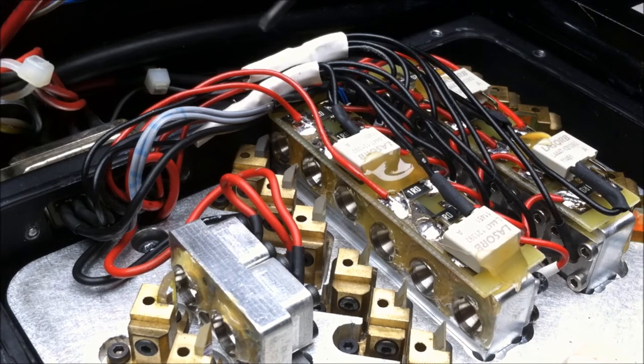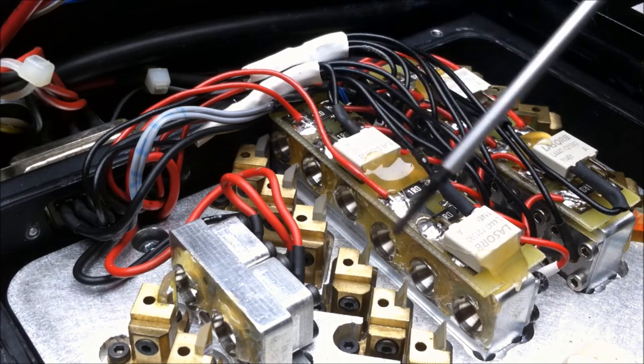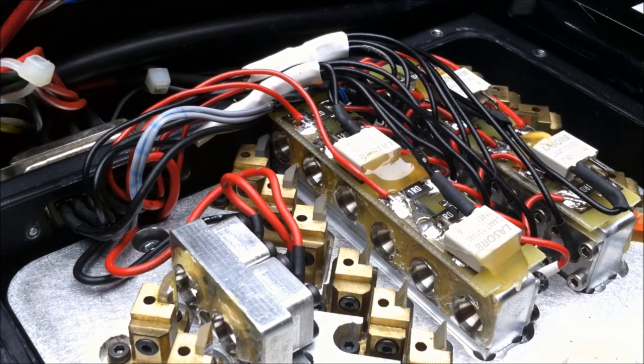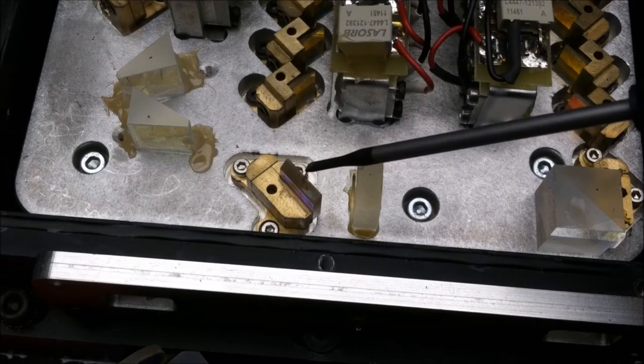Here on the other side, the side with the blue lasers, it's the same thing. So you've got six more laser diodes. Once again, three more on the top and three more on the bottom. Now, these get combined with the other six to put 12 lasers in one beam. So first it has to be bounced off a mirror. That mirror is this mirror located right here.